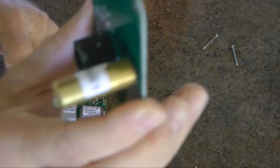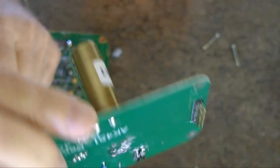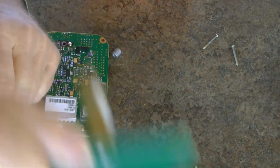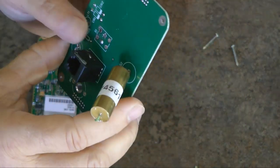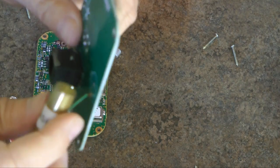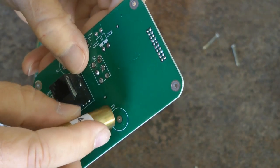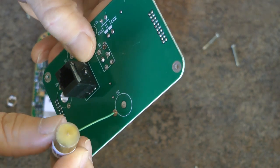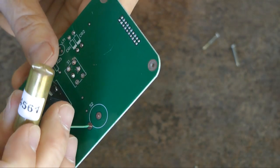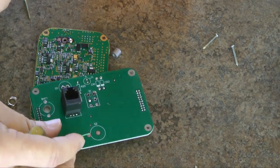I can hear a little bit of a click when I shake that switch, because that basically is what turns on the transmitters to send the distress signal in an accident. I notice that there must have been a poor solder connection there - that G-switch broke off of one of the connections at the circuit board end. Again, our technician will take care of that. But it is kind of interesting to shake that G-switch and you can actually feel a little weight in there of some sort. So this is all of the parts that make up an ELT.